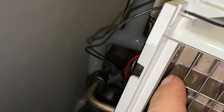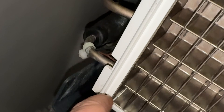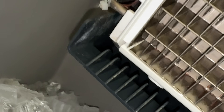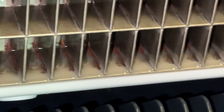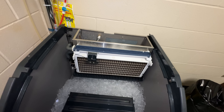One thing I noticed — look at that right there. That seems like it ain't supposed to be like that. Normally it's going to be tight like that, so we may have an issue there. It doesn't look like it's soldered in there, though — shows no solder joints there, but maybe it's not a big deal. It doesn't seem like it's flexing. Anything that would hold the ice on the plate could be an issue. You can see we're having some issues down here on the copper plate — it's nickel coated — and it's not doing real well there. That can cause some issues for sure. Their guys have been cleaning it and they're not always the most thorough, and they could be running something in there that's too potent.